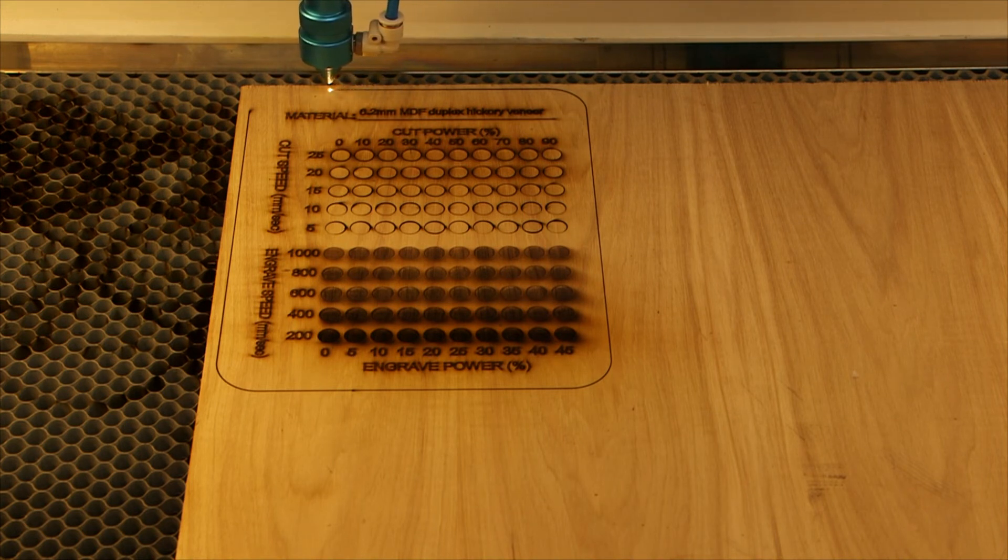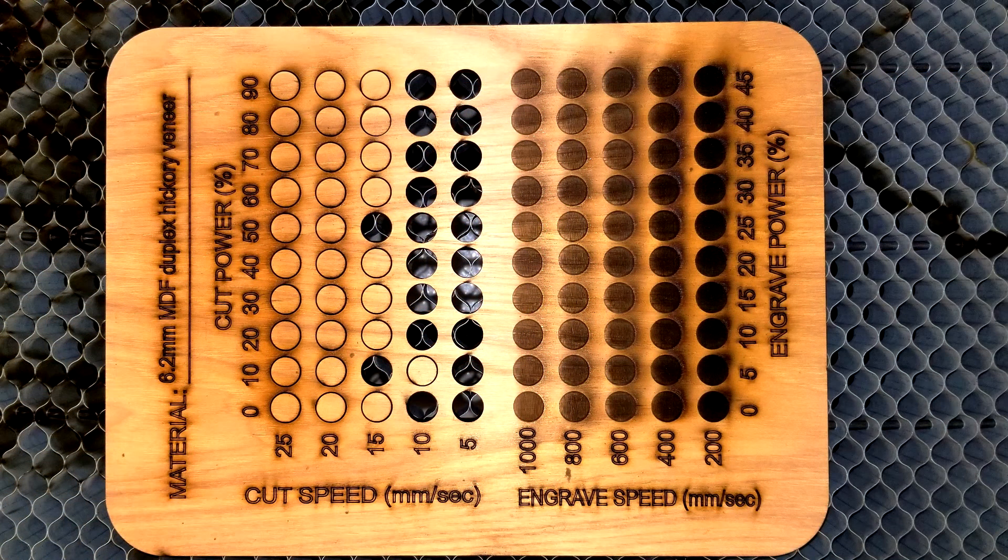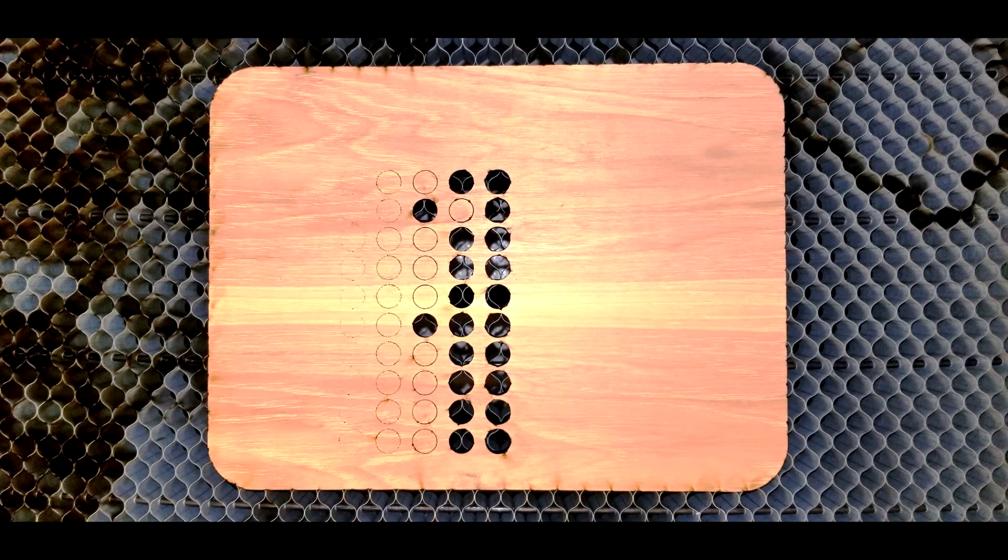So it's almost done, and I'll provide some good images of the test target. These settings are a little hot and a little slow for thin material. If you were to do this on like three-ply birch — three millimeter birch — you'd just burn right through it. So you have to adjust your powers for the scales to do their job, or you'll have to adjust the settings to suit your laser.